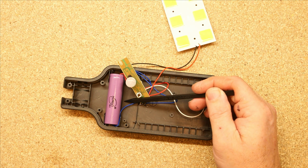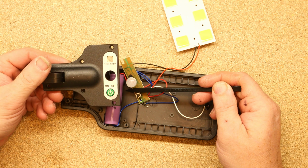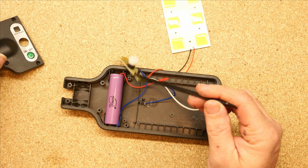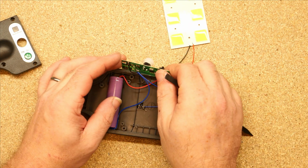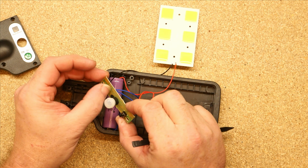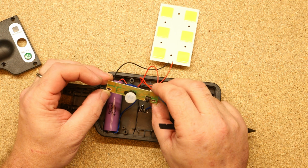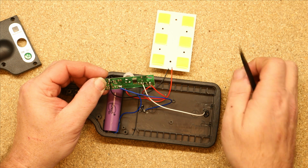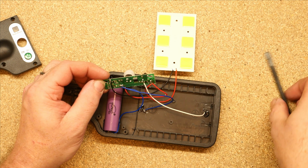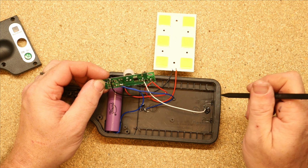So my plan, my problem is this board. Where's that cover? So I just noticed, me saying that I didn't receive the infrared remote for these, there is no infrared remote receiver. Even though I had received it, there is genuinely no provision for that. So I'm guessing this is just going to be a micro that handles the different modes. Your modes are always on when it's dark, on when there's motion detected, or dim until motion is detected, then it comes on full power.